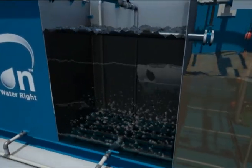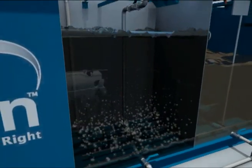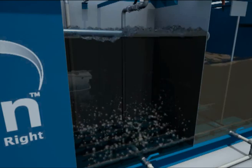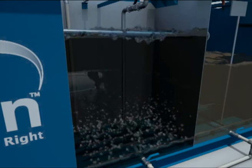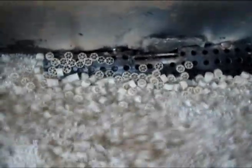Aeration is provided using stainless steel air diffusers. Side channel blowers with 100% redundancy supply the required air to the diffusers. Almost half of the aeration tank is filled with bio-media to increase the biomass population, thus reducing the required footprint. The bio-media is made of polyethylene and has 850 m² per cubic meter of surface area, housing many different microorganism populations needed for wastewater treatment.